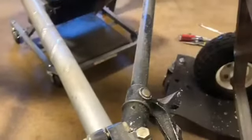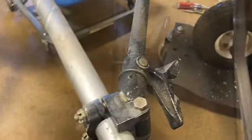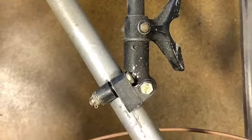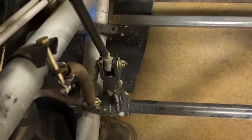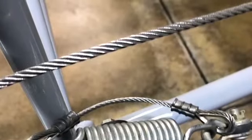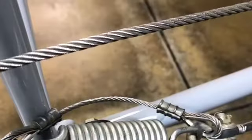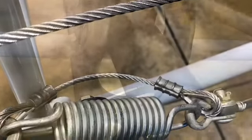There's the control locks as they go down and lock in. When airplanes are sitting out in a field and the gust winds come along, they'll mess with the control surfaces, so that just locks them and keeps them from banging and tearing themselves up. You do want them to move with ease, but when they're sitting there in the wind just moving around — that's that safety chain. The rudder spring.